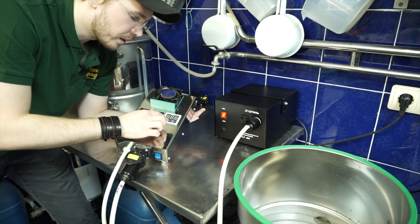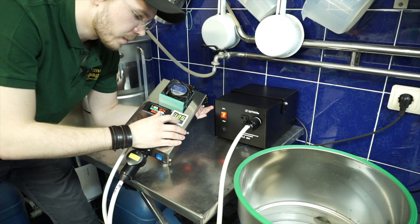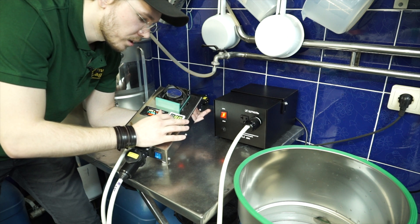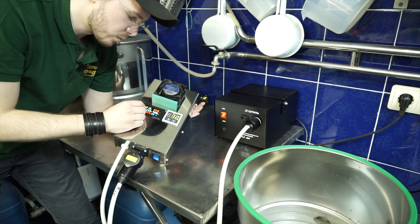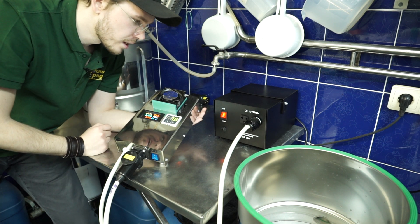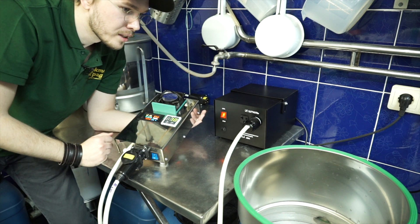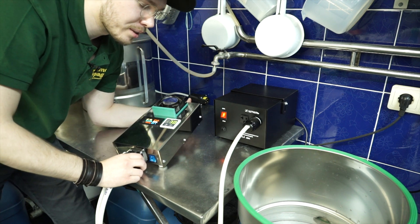If it's going to be operating at maximum power, right now it's operating at 125 volts. Let's decrease this amount — down to about 50, 17 volts — so the power right now is 600 watts. We're just using a small amount, and we can operate it with stable parameters all the time. The noise is because of the transformer — you won't have this noise if you use your own outlets and circuits at home.